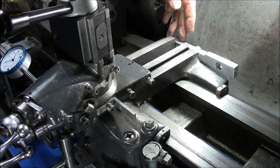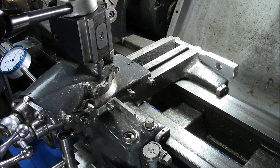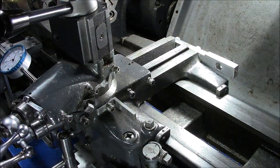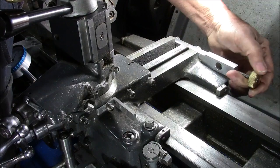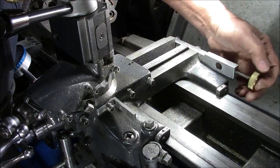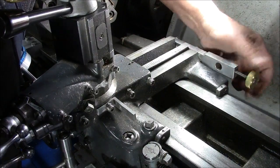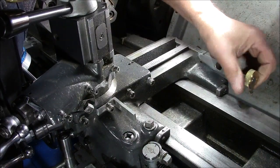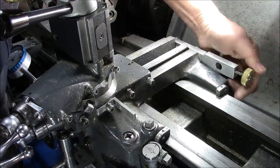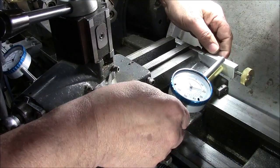That adjustment screw back here — I'm explaining how it isn't square — allows it to run perpendicular. Here's the knob being put in. I had to work around the camera, around the stand, and around the light. I'll let you share my frustration with having a hard time putting this knob in, but we eventually get it in. I could have probably countersunk this hole a little bit so I didn't have to screw it in so far, but since it was aluminum I said, well, what the heck — I won't be taking it out that many times.